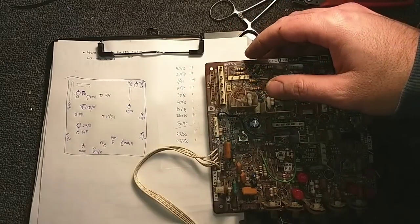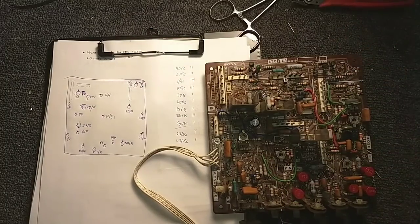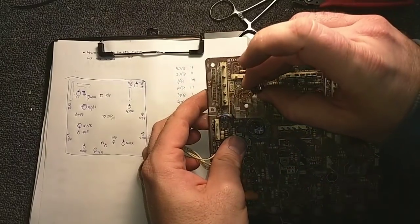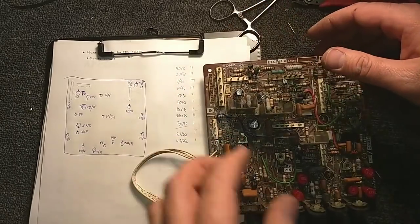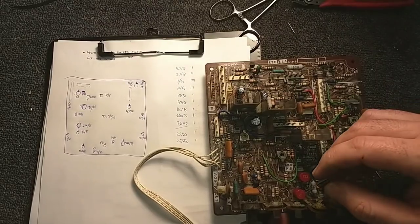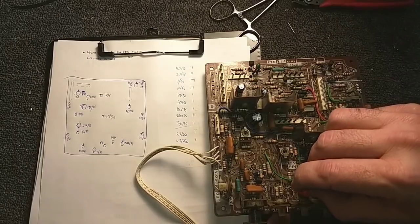And I'm bending the leads over at the bottom with my hand. Here's that big 2.2 high voltage cap, which certainly isn't as big as the old one. Amazing how we've shrunk in technology. You're a 100 at 35, so you go down here at the bottom.